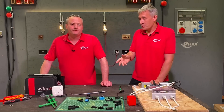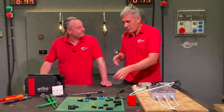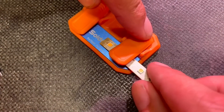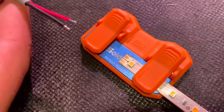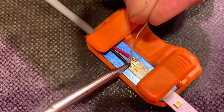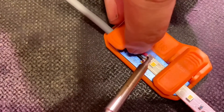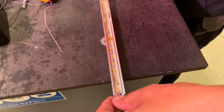Following on from that, I looked at an application for the two-way connector in LED lighting. One of our favourite things at eFix is soldering to LED strips — it's considerably easier to solder in controlled workshop conditions rather than trying to do it on site, whether up a pair of ladders or hanging upside down underneath a pelmet trying to make those connections. My top tip is to put a short length of cable onto the end of the LED extrusion and assemble it in workshop conditions, then take it to site and just plug it together.